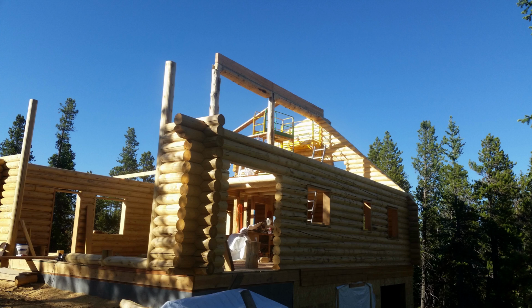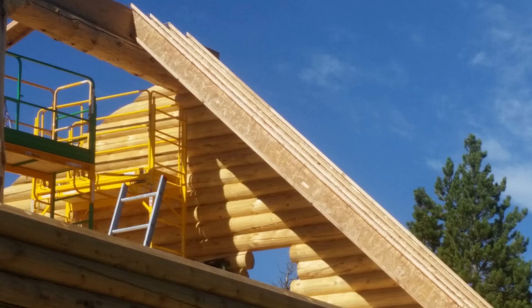It was at this point that I realized that the GL beam that was on top of the ridge beam was too high. I had to cut off 6 inches horizontally of the GL beam to get the roof joists in the right position. I confirmed this with Lazarus Holmes and the guy who did the engineering of the plans, and all they could say was they're sorry, but that didn't help. Now I've got the GL beam cut down to the height I need.